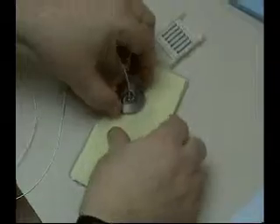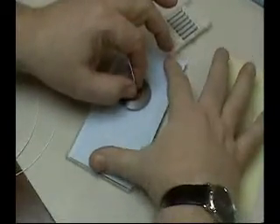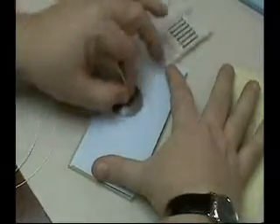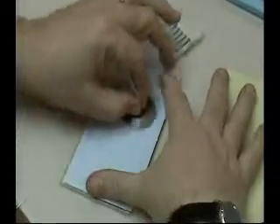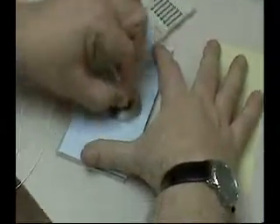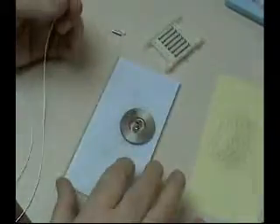The grooves have to be quite visible. When you're done with this, you have one more process for five seconds. It's the 1/3 micron paper — you do exactly the same. You hold the paper, secure it, and polish. Go very gently and faster, using a figure-eight shape, for another five seconds. And that will do. You have now installed the first ferrule on your fiber.